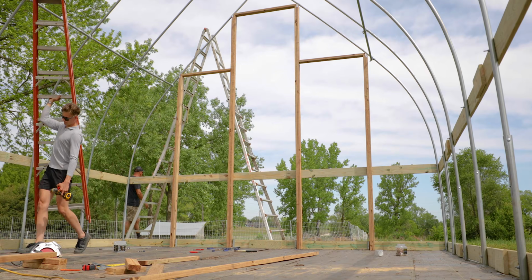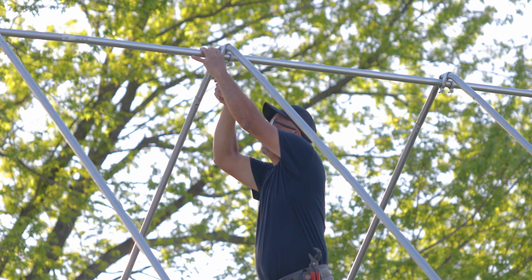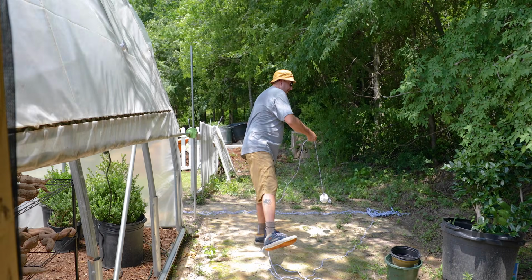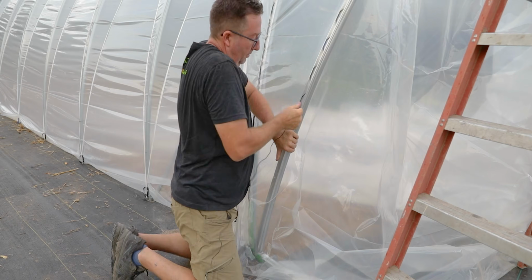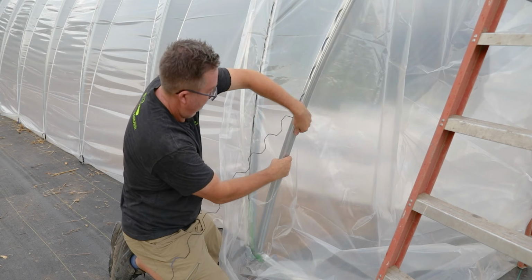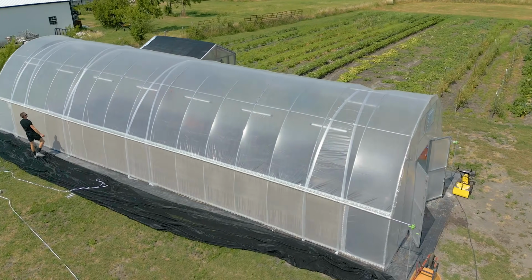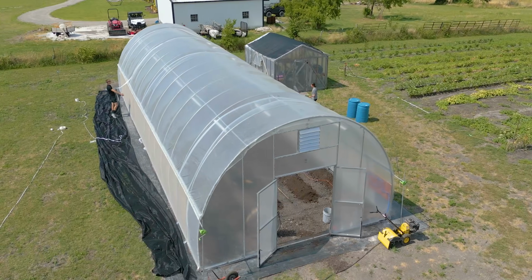Also, use that to determine what the size of the truck is going to be, maybe the number of people you're going to have, and again, the height is going to help you determine, are you going to need a ladder, rent some scaffolding, or rent a lift? And while you're hopefully on property, before you make the transaction and you're assessing the structure with your own eyes, go ahead and throw a rope over and measure the hoop house plastic. And if you do commit, go ahead and get that plastic on the way so you don't have to wait on it. If you need more help measuring hoop house plastic, there is a link in this video on how to do that very simply, or you can call our customer service line and they can send you a link or walk you through it.